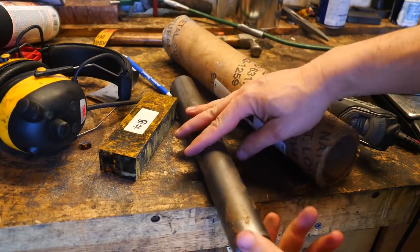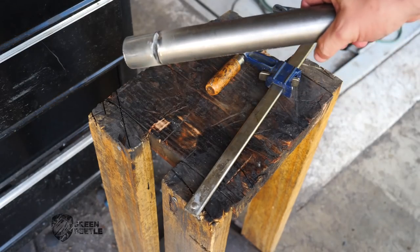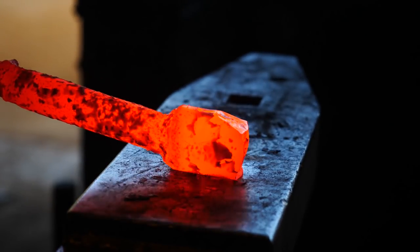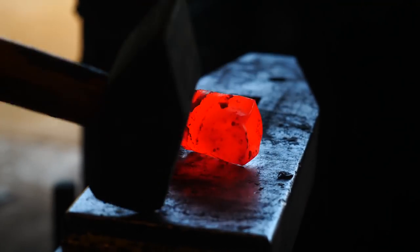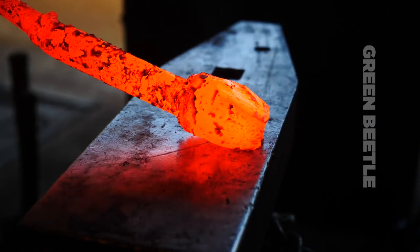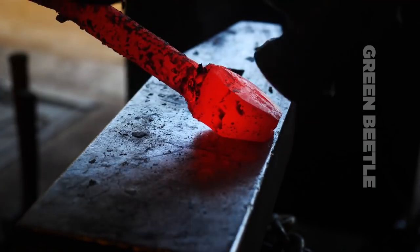While I tally the votes in the comment section for part 3 of the video series — for which guard you guys prefer — we'll start this pommel. This is 1018 mild steel, so there's lots of upsetting going on here. There are going to be some cold shuts in the tip, but that's just more material at the narrow end that I don't have to remove when making the hole or slot for the tang. This is my first sword — as you guys have figured out, this is not really a how-to series, more of just how I made my first sword and some of the things I learned.